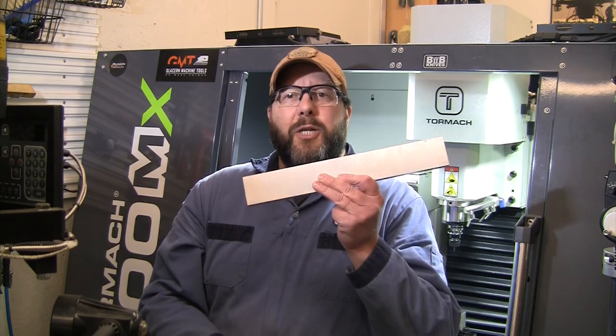So first, we'll go up to Fusion, we'll take a look at where we were in the design, what we're going to program, and what we're going to do to continue this on. I've got a chunk of material here, we'll get our stock cut, and we're going to work on patterning the part in Fusion so I can make two of them. Make a jig plate so that we can flip it over, machine the backside, which I didn't do last time, and go through all those steps.